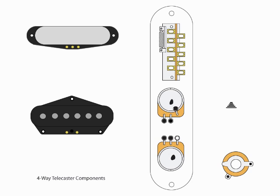Here you're taking a look at the components. Obviously keeping the same pickups and pots — most people use 250k pots for the Telecaster, same as you would with the Strat, but personal preference if you want to go different you can. You've got your jack, your ground, and a 4-way switch. You can't use the existing switch; you do have to go out and purchase a 4-way switch.